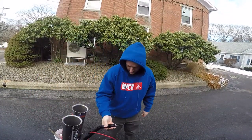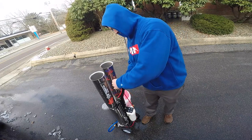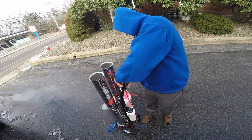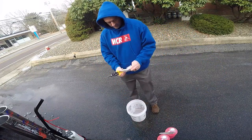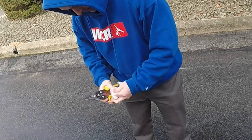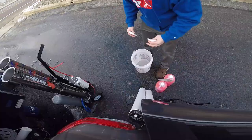You'll also notice that I have my drain hose long enough so that I can clip it. This will prevent the water from traveling up once you refill these and draining out the bottom. You could also even pinch it — that just provides a little more resistance. Now, we've got our two RO Protect packets, one for each membrane. Do this like a packet of sugar — have something to cut it with. Cut it over the bucket; just good cooking practices. Always operate over the bowl, so they say, and we're going to pour that in.